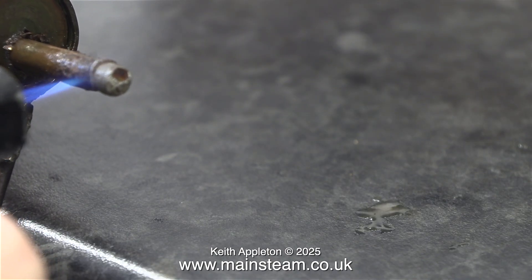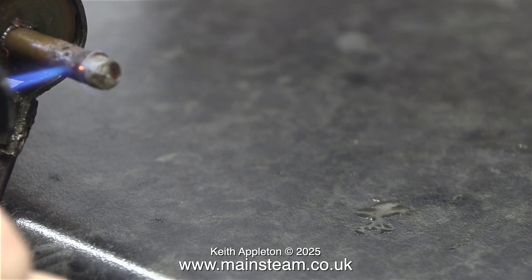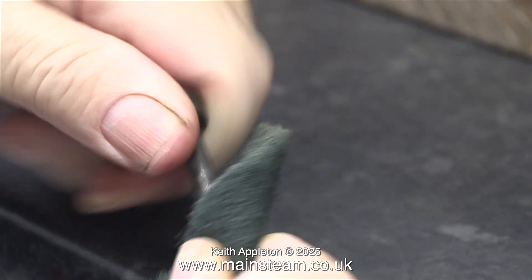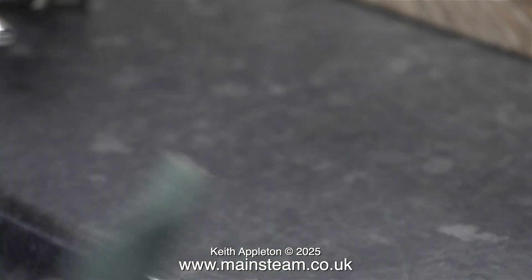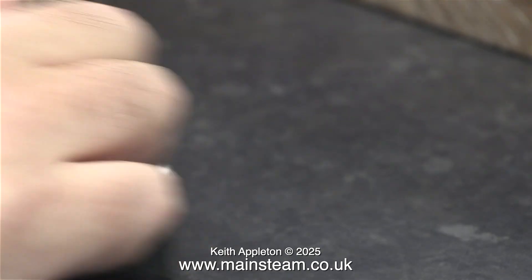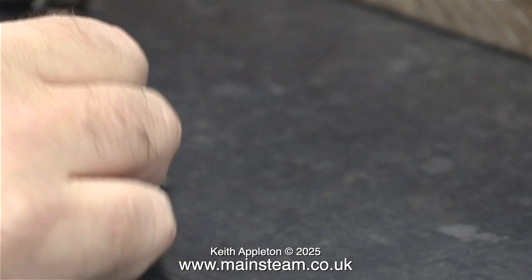I've yet to make the flywheel and I haven't decided the best way to do it. James Evans is sending me a brass flywheel. I really don't think this Chinese flywheel will look right. I do have an unmachined Stuart number 10 flywheel that I could brutally machine and reduce it to a very thin size. Once I melted the solder on the end of the crankshaft using a small blowtorch, I cleaned it off with a cloth first, then used a piece of Scotch-Brite to clean up the rest of the crankshaft.